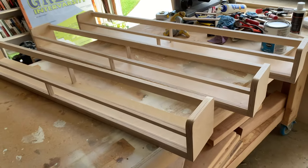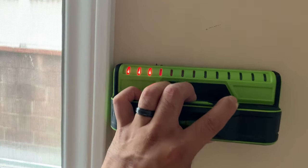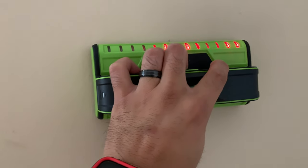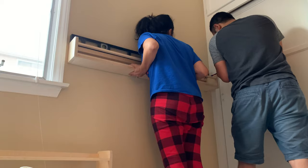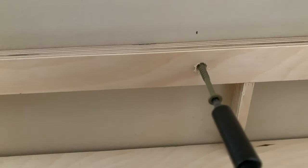Here's how everything looked after applying finish and sanding. The last thing was to bring them into the house and mount them up. The gap between the window and the closet was 4 feet 2 inches, so they fit perfectly. To begin mounting I used my stud finder to find and mark all the studs in the wall, transferred those marks over to the back brace, and countersunk holes into them. Then my wife helped hold everything up with a leveler while I drilled the screws in.